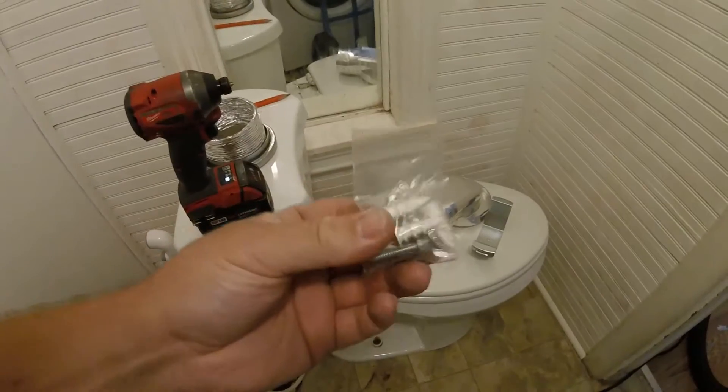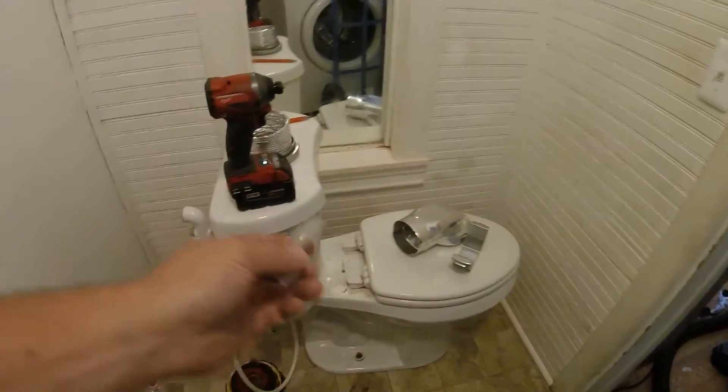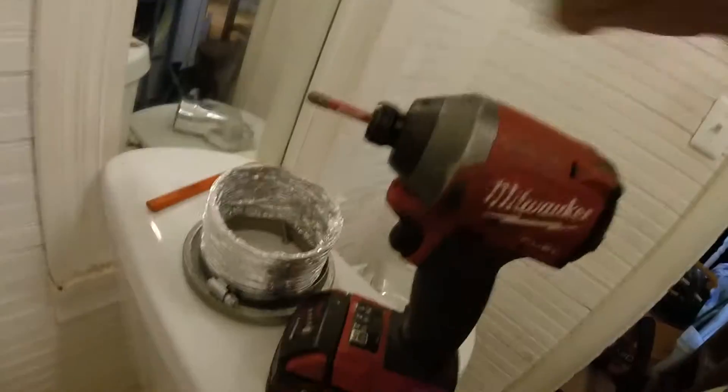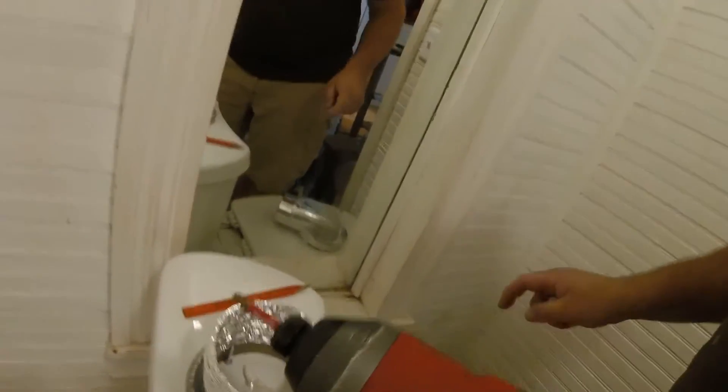The tool I've chosen for the job is this Milwaukee quarter-inch stubby impact driver. The makers of the vent kit give you self-drilling drywall anchors. I've had pretty good luck with these — you simply use a Phillips head driver, screw them into the wall, and then screw the screws in. It's difficult to get a camera angle back here, but as you can see, those easily went into the drywall. Three out of four did — the fourth one did strip out, but sometimes that happens. Fortunately I have some extras. Sometimes it helps to install them with a slightly larger bit. I'm going to stick another anchor in there and then get this bracket screwed on with the included machine screws.